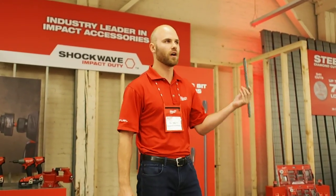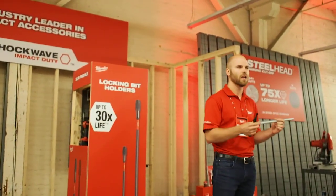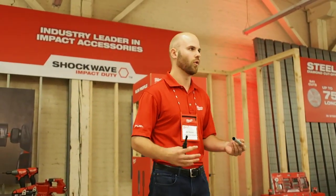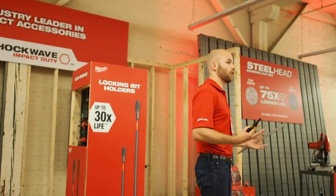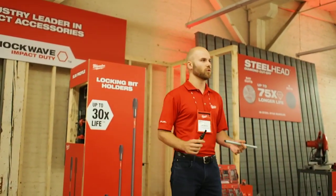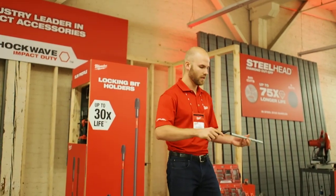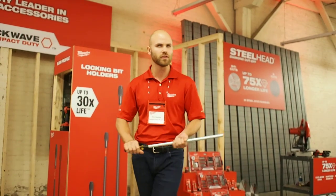They'll use a bandsaw, metal cutting saws, Sawzalls even, which will all leave burrs on the ends here. Now before you can actually install that into a gang box or run electrical wire through it, you need to deburr the end of that. We also call that reaming. So there are 2 main solutions in the market right now, one of which is a reaming screwdriver like this. Very manual process and very time consuming. It can even lead to user frustration, user fatigue.